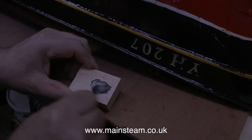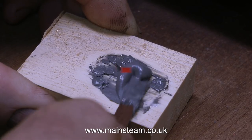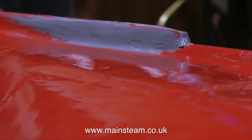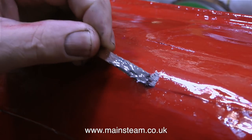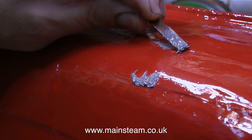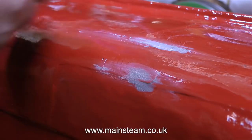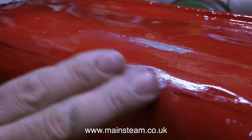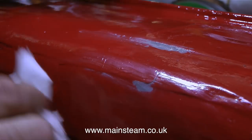I left the paint to dry for 24 hours, and the next day I'm straight into the JB Weld. Here I'm mixing some JB Weld to repair some of the damage I found that I wasn't aware of until I started painting. This is the damage to the keel — in this clip I'm carefully spreading JB Weld over the damaged area. A good tip: if you wet your finger you can smooth it out very well without even rubbing it down. In this clip I'm applying some JB Weld to cracks in the hull where the panels are starting to lift — this should stop any ingression of water. I'm removing most of the JB Weld with a cloth, then using water on my finger to smooth out what's left. I used to do this with Milliput when building model steamboats, and I found that water on my finger smoothed it out beautifully with very little sanding needed.